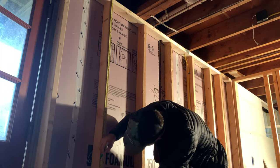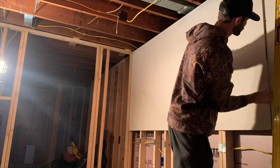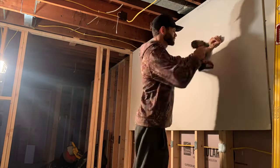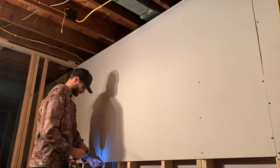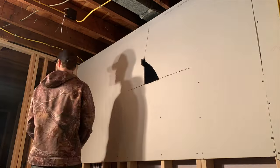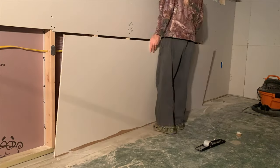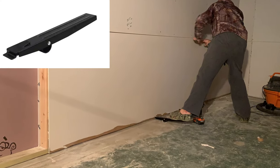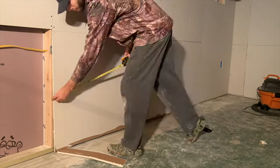If you're hanging drywall on your own, you can mark four foot and a quarter inch from the top of where you want the drywall to hang and install some temporary screws. Here's a look at that installed at four foot and a quarter inches on both sides. That way you can lift the board horizontally, rest it in place on those screws, make any adjustments, and then once everything looks good, you can attach the drywall every 16 inches on center. After hanging the sheet, I cut around the receptacle box and cut out the window — this time I used a drywall saw and got a better result. Moving on to the bottom, there's a tool that lets me lift the drywall up so it's perfectly flush with the drywall above — I'll link that in the description.